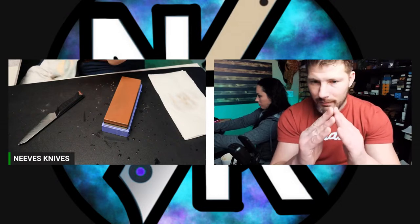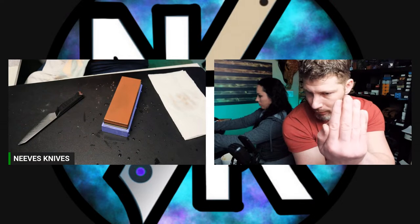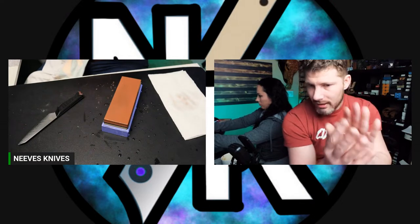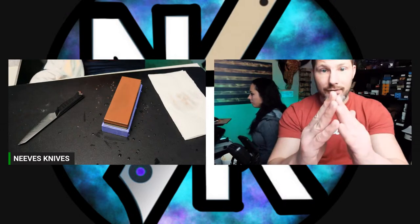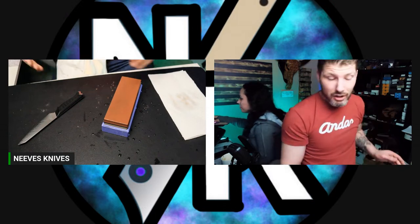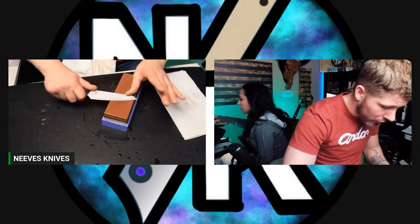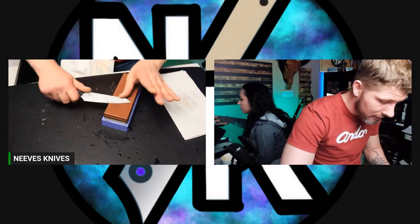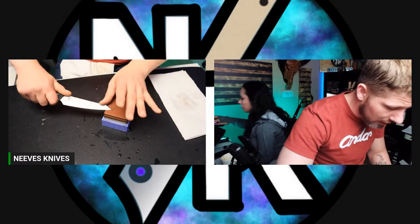But if that doesn't come off good, what'll happen? You'll have little chips in your edge. It won't be perfect like this. It'll be like this, where there's still a burr left on there. So you need to make sure that you have a good understanding of how to identify the burr and how to remove it on your last stone.